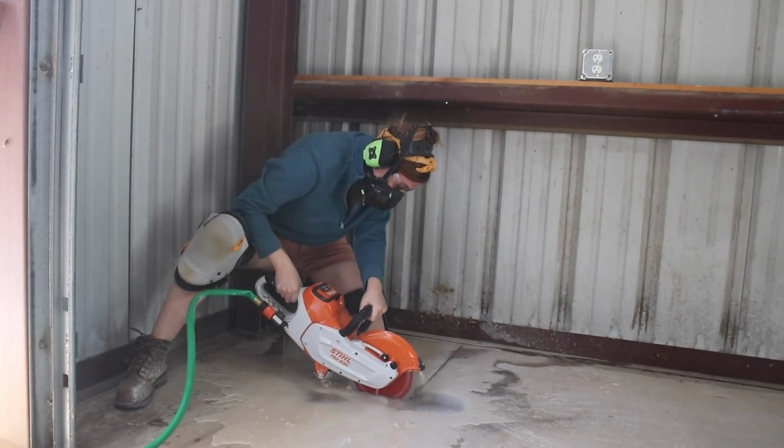Okay, and then the last thing I wanted to accomplish this week is roughing in that plumbing. Typically, plumbing is put in when the slab is being poured. So what do you do if you have a solid slab and you need to put some PVC pipe into it? I mean, that sounds like a great excuse to buy a concrete saw.